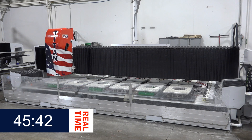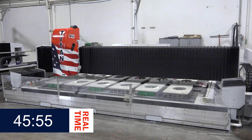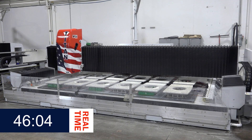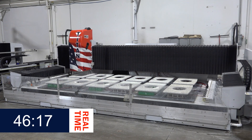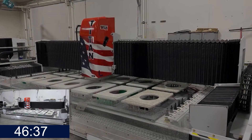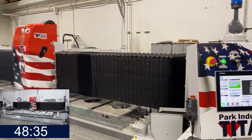What we've done on the Titan 3700 series to allow all this is we opened up the water flows and brought larger water lines in. We're now throwing roughly about 20 gallons a minute of water at these tools between the external water ring and our center water feed. This high water flow allows us to remove that excess material quickly as these tools are moving at much higher speeds than what past basic high speed tools were running — roughly 180 inches a minute. In our old machines running the half inch lines we were maxing out at about 12 to 14 gallons a minute. So if you own an earlier version Titan — say a 1700, 1800, 2700, or 2800 — you can contact Park Industries in the service department and they can sell you a kit to upgrade your machine to run these high speed tools as well.